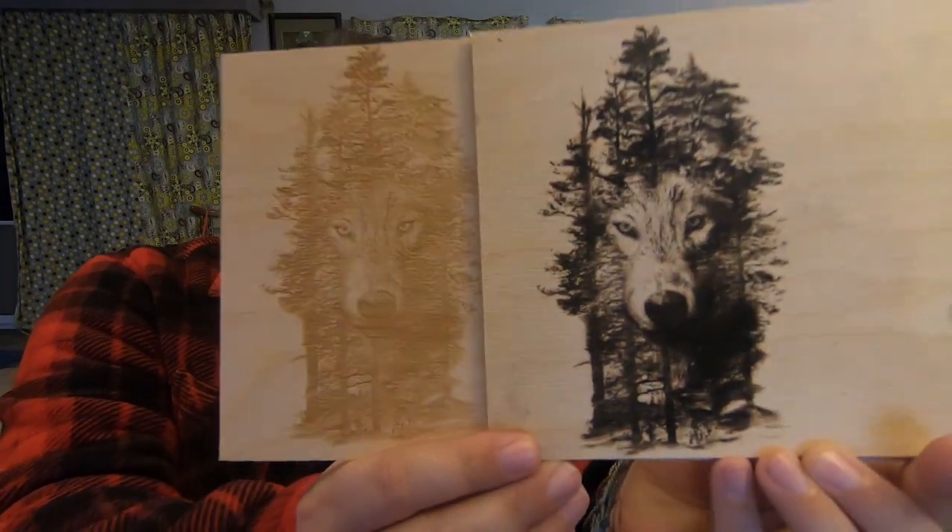The detail is super, super good. The detail is great in the plain engraving too, it just doesn't really pop like it does with Borax. Baking soda is fun to play around with — it'll get you darker than normal, but it is not going to do what Borax can do. Really, my key takeaway is that Borax is the best. If we're just going to engrave a photo and want it to sit on top, use Borax. Need to adjust the DPI down a bit — the 1200 DPI spec is probably for absolutely perfect distance and perfect focal point, which isn't realistic most of the time. Turning down the DPI prevents muddying your picture; backing it off a bit and having a little less detail actually ends up showing more detail.